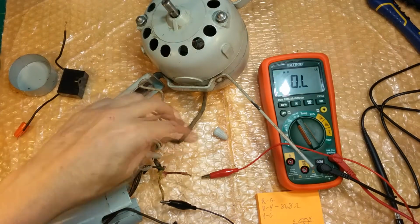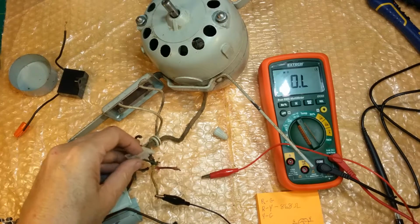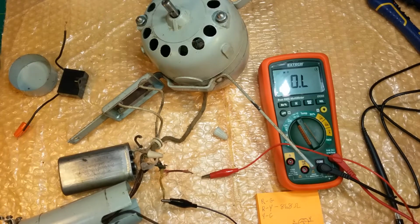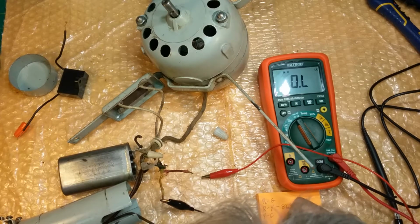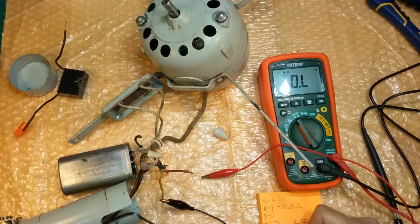Okay, so coming from there, we go to the green wire. We also go to the capacitor, so I'm just going to draw the capacitor right here. Okay, and that's just that side of the capacitor. They're connected to the green. So, since that's going right to the motor, that's probably high on the switch. So we will draw the AC switch here, the AC plug, and we'll have a wire coming out, comes down to a 0, or off position, and then there's a 1 and a 2 position, 2 being high. So most likely, this green comes around and connects to high.